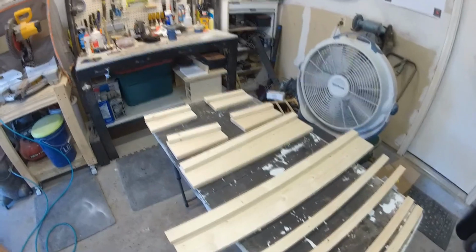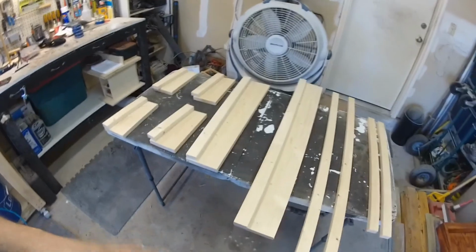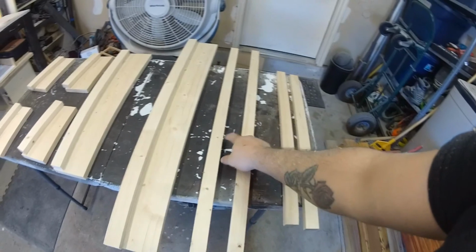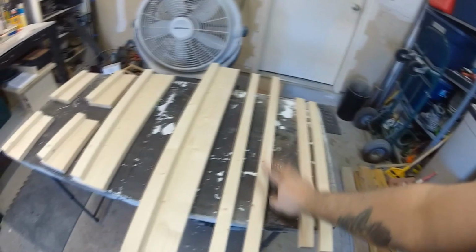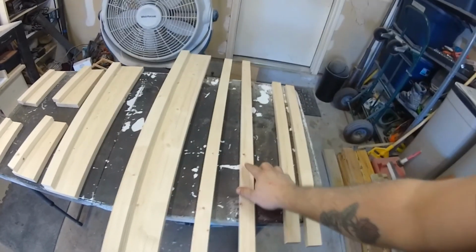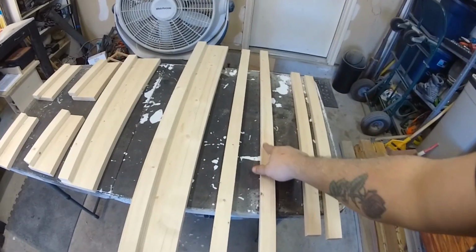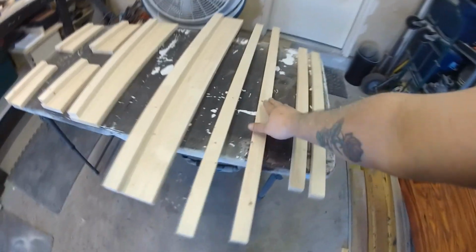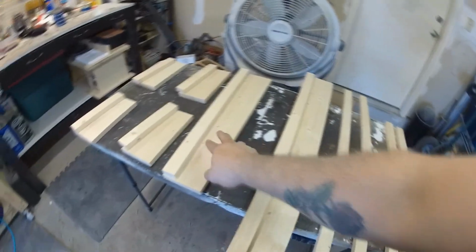Okay, now hopefully you should have something that looks similar to this. And this is again using three 1x5x8s, just whitewood common boards. Because of these knots that are in this whitewood, that's going to be the problem if you decide to paint it white. If you're going to stain it, then it's not really a big deal. Just sand it. It'll give it character. If you decide you want to paint it white, then we do have to seal it because these knots can come through the paint. So I'm going to end up using probably sanding sealer, if not maybe some Bondo or wood filler or something, just basically to cover this up, and then paint it white. And none of these knots should show through the white paint.